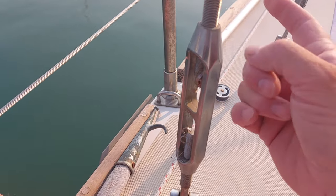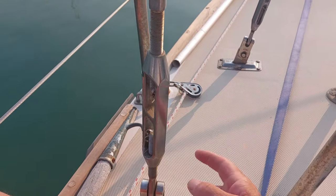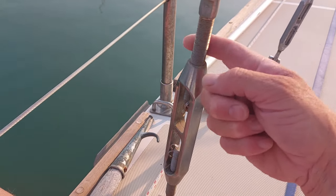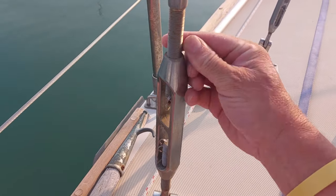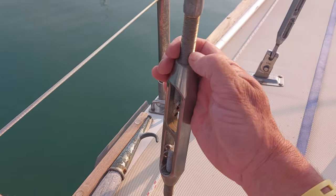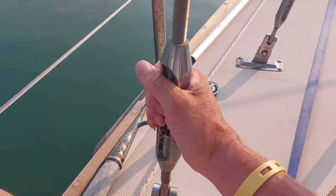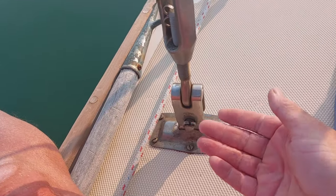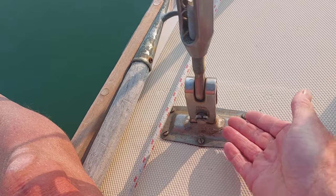Please don't wrap PVC tape around this. If you see PVC tape wrapped around these things, take it off — because the moment you wrap PVC tape around this, you starve the oxygen, any moisture gets trapped in the threads, and off you go with crevice corrosion. These are just over five years old and I've just had a good look around them — they're all good.